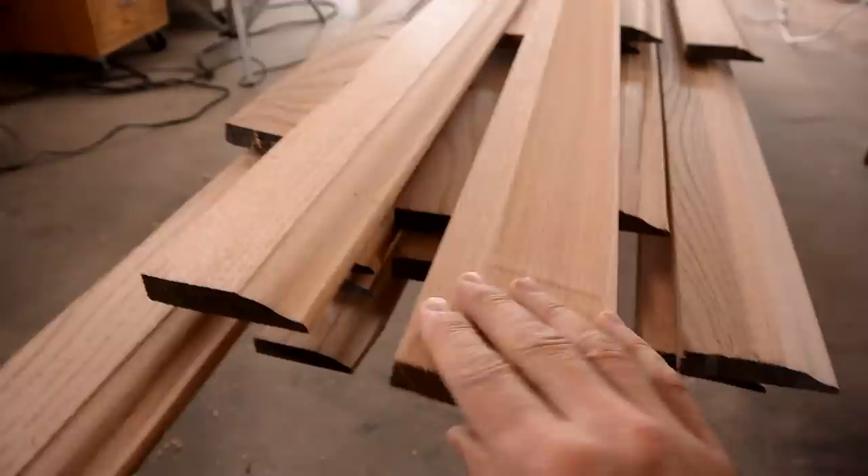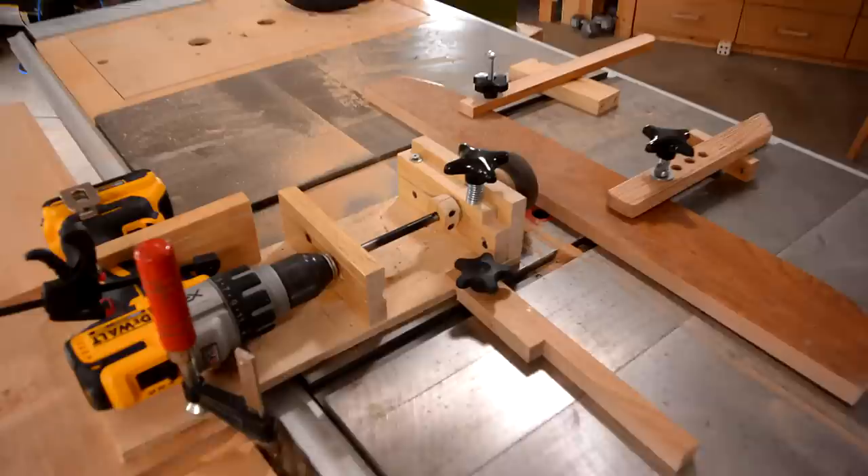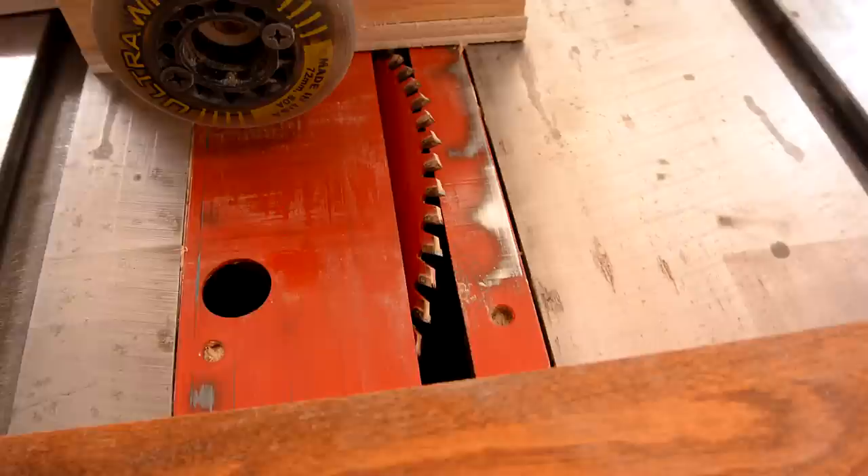Here's the round-over I just added. And to make sure the top edge stays flat against the wall even if it's uneven, I'm adding a hollow cove cut on the back, and I'm doing that on the table saw going sideways across the blade. Once again with a power feeder — I set the blade at a 45-degree angle, so as the wood comes in, the top of the teeth do the cutting instead of the sides, because that works so much better.